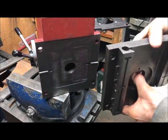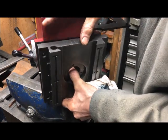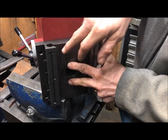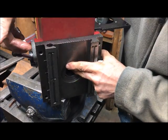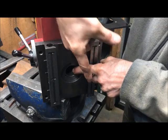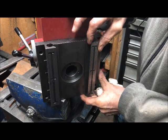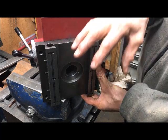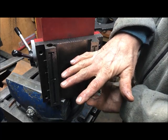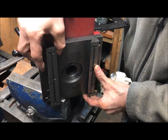The method they used for alignment: look at it from the point of view of these taper pins. The plate sits here, and then you have the gib there of course, all clamping down. At least the taper pins take care of the location. If the spindle is now pointing to the left, as I said, from the front, it can be corrected by scraping down here. I would say the column represents the foundation, and this is the top floor - so I would rather adjust the top floor than the foundation. The foundation should be accurate.